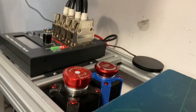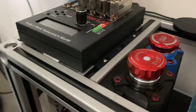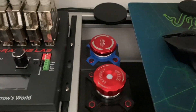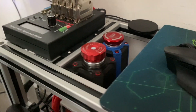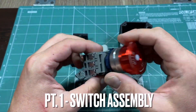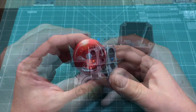Power lines are secured on the bottom with standard PG7 electrical cable fittings. I designed two sizes of boxes fitting up to 32 or 40mm sized switches. They are roomy enough to accept at least two Wago quick connectors inside. As always the design is modular so I can move around and rearrange them as I please.